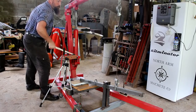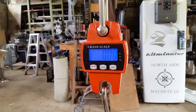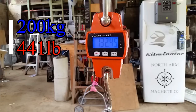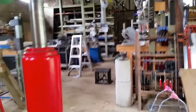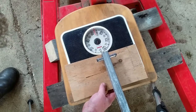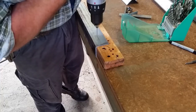Basically what I've done is set up a three-to-one mechanical advantage ratio to the bathroom scale. I use a digital scale to calibrate my bathroom scale rig — so 200 kilograms here reads 66.7 kilos on the bathroom scale. It's not super scientific, but it's very accurate. I started with a beam scale that I actually machined up on a mill to be as accurate as possible, from a build I did years ago, and modified it to use on the engine crane.